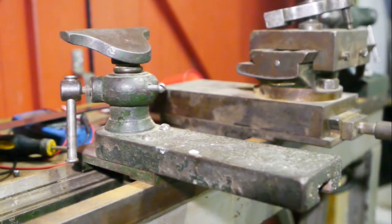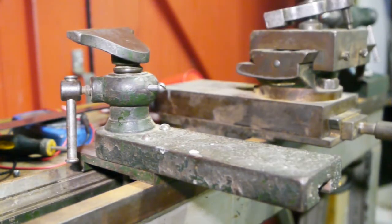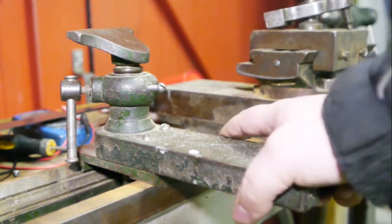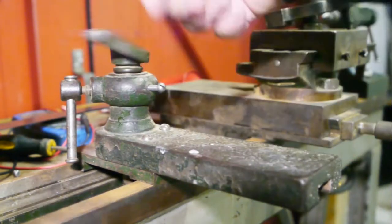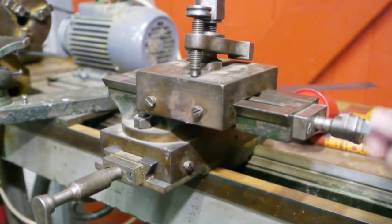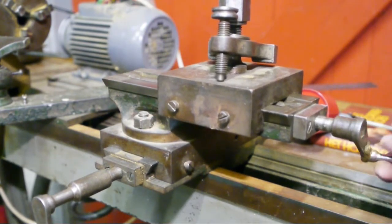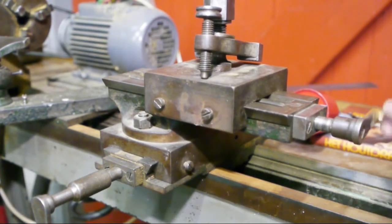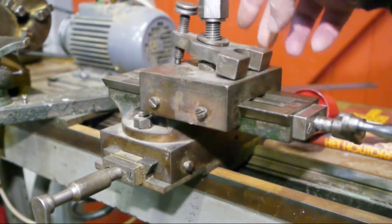Here's the wood cutting tool rest — looks like somebody put it back together the wrong way; it's supposed to be the other way around. The slides run backwards, just like with the 'worst lathe in the world' video — somebody replaced the thread and used the wrong type. It's supposed to be a left-hand thread, not right-hand. Same stupid tool holder.